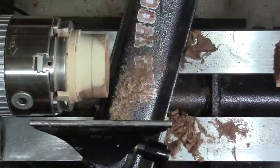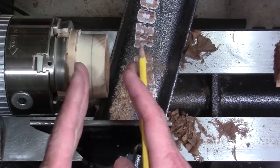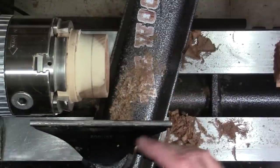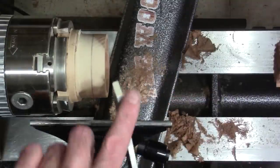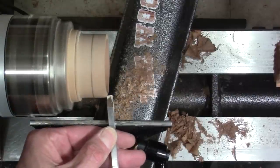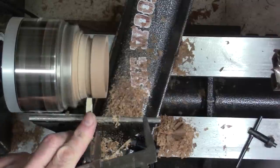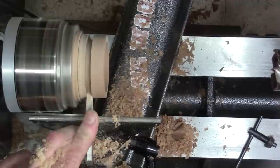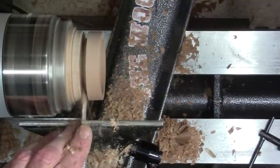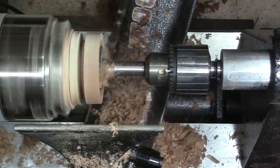What we're going to do is come in with the parting tool, but I want to clean up the face here. On this side I want to taper them in just a little bit so that they seat together nicely and there's not a bow that leaves a gap. Lathe speed is back up to 3,000. I'm bringing this down to the diameter of the first Forstner bit — the 2 and an 8th — creating a little tenon so that the rings will lock together and won't flop around. Then I'm going to come in with a thin parting tool and go down about a quarter of an inch past this, then use the Forstner bit to go all the way through and part it off. There's less chance of it breaking this way.